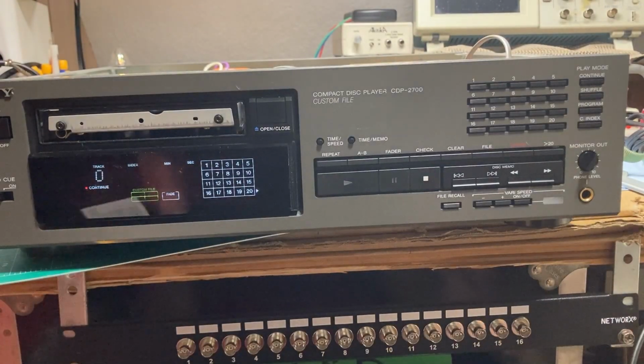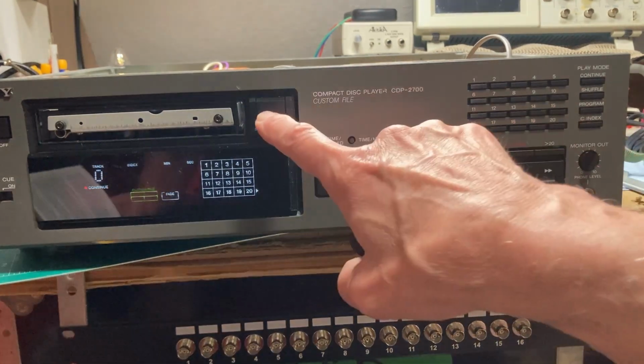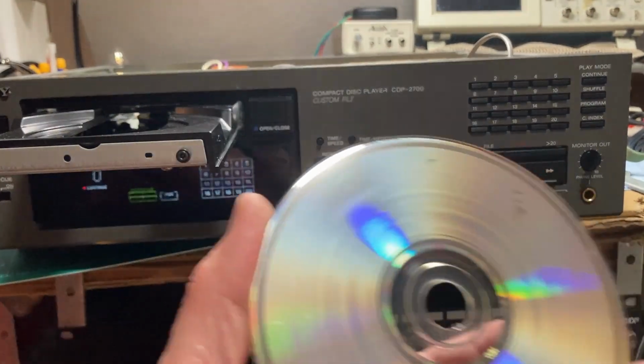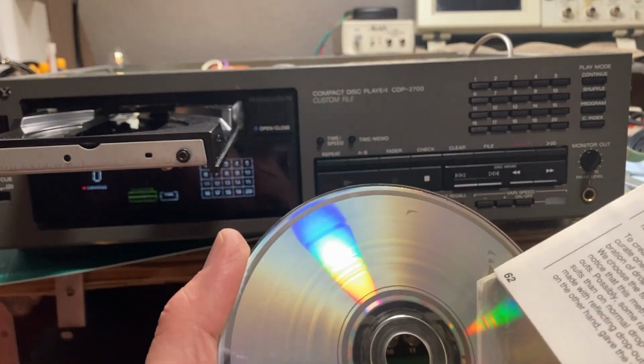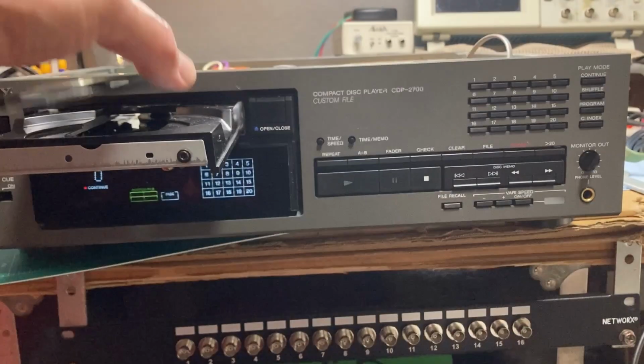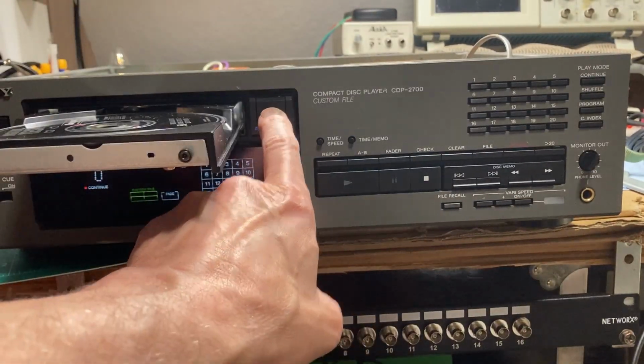They're test tracks, and they've got gouges on them intentionally to see how far out of standard the CD player can play. And it's said that every CD player should be able to play 0.2 millimeter gaps. By gap, I mean an actual physical gap. You can probably see some of the large blemishes here. Those are intentional on this disc for that very purpose.